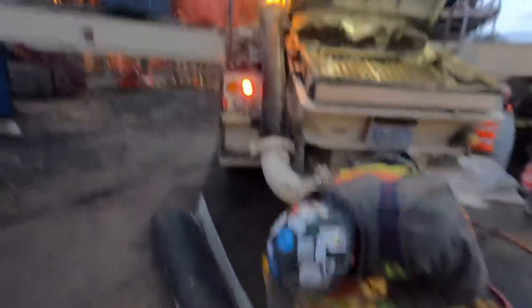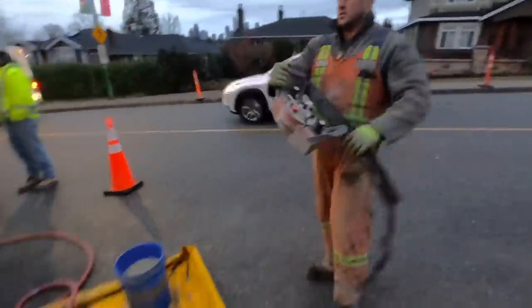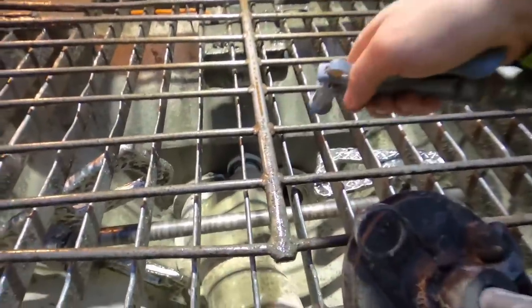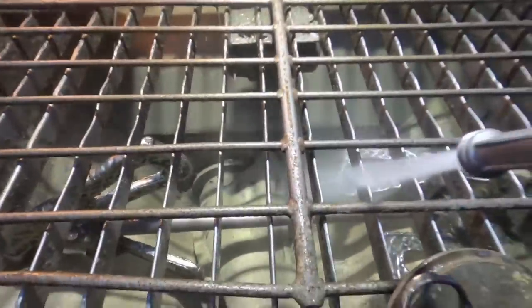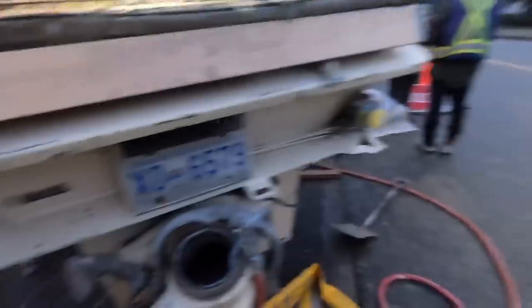The other thing we're going to do - if Sid wants to grab his remote control, which is sitting up on the driver's side of the pump - I'll hand it to him, throw him the remote. Take a few strokes in forward at full volume. Even though I'm using bentonite, I still like to pre-moisten my barrels a little bit - a good habit just in case there's any gravel or schmeg sitting in there from the last time the pump was out.